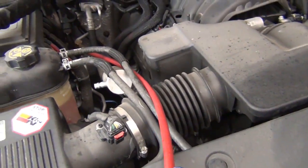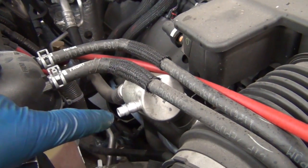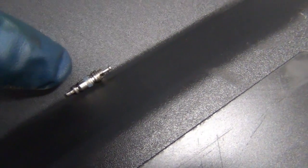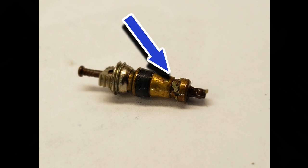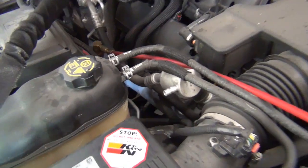Going through the winter, we got a lot of moisture — saltwater from the roads being salted. When we pulled this valve core out, instead of looking fresh and shiny like this one, it looked corroded. You can see there's a bunch of rust on the bottom end of it, and you also see some aluminum shrapnel. That shrapnel comes from the compressor.